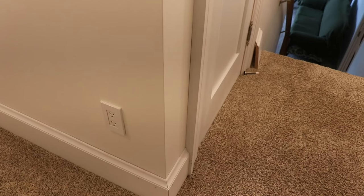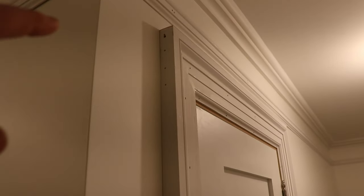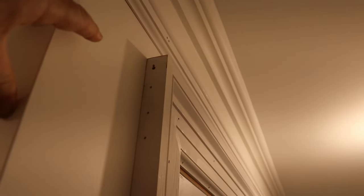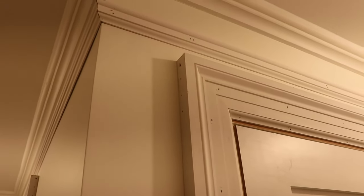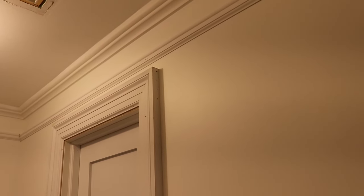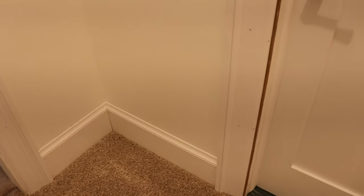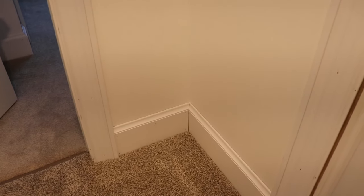The depth of the profiles is nice so you don't have the baseboard sticking out past the door casing. I used trim screws for the corners — one going in from the side and one from the top — and then a fancy clamp for squeezing them together. I'll put a link in the description. I couldn't get the original ones — they're called clam clamps — from the guy that makes them in the States, so I went with the Wood River generic ones and they are quite good. It's his own fault for not selling me product when I was ready to buy it.